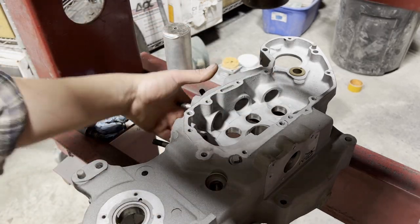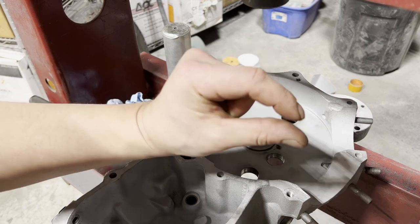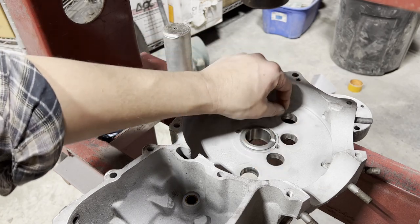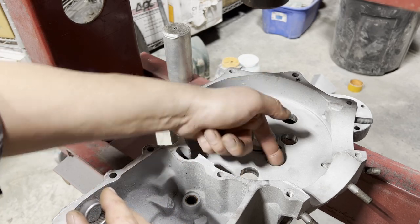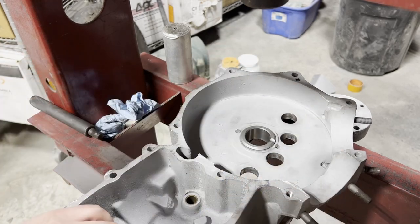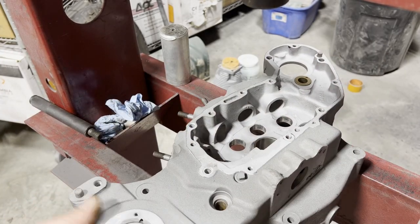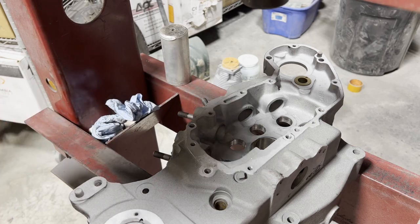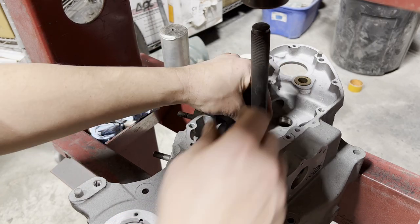On several of the cases there is a super micro machined lip in here on the inside — it's tiny and very easy to break. A lot of the times if the motor's been redone or somebody was sloppy with it, those inner lip parts are broken off. On this case they're broken off — I can see the little chunks here. So what I did was grab a file and re-soften all these edges so there's nothing on the back side. Know that if you press these crazy and drive them all the way in or go too far, you will split the back side of that case.